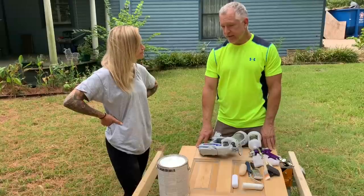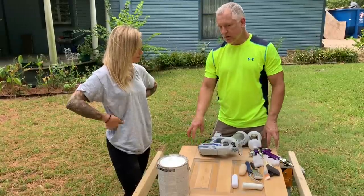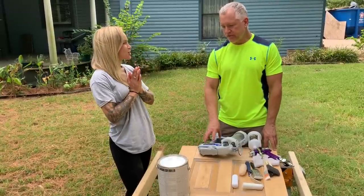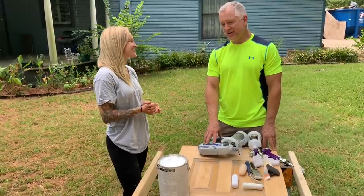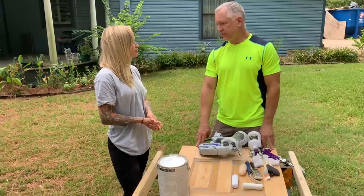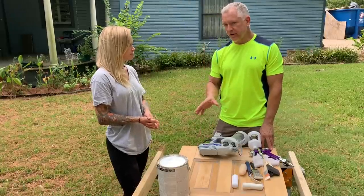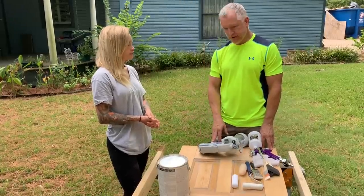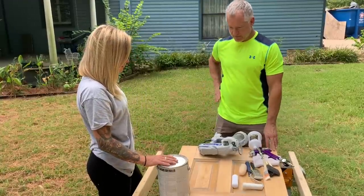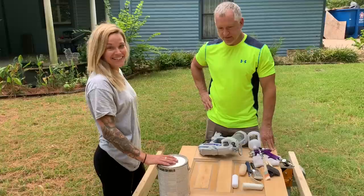And as I think you mentioned before, with this door, with any door, always prime first. Yes. Priming is very, very important. It creates a much better bond with the painted surface than just painting by itself. So you should always prime first. The paint goes on better, it looks better when it's all said and done, and it also holds up better. Yep. You get less chance of it peeling off, which can happen with some paints. Alrighty. Sounds good. So is it time to start painting now? Yep. Let's do it. Let's get started.